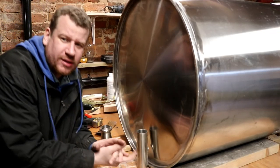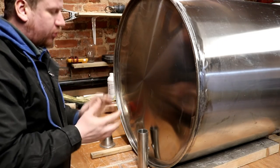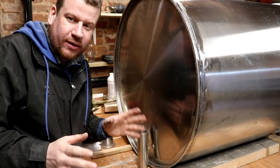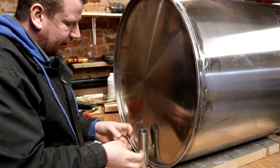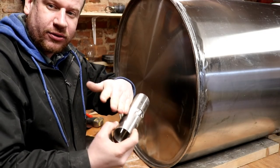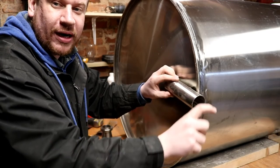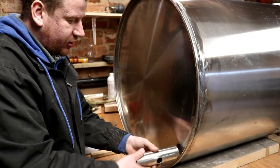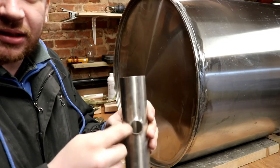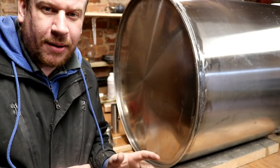I've spent much of today considering my position with tanks, fittings, and everything else I'm going to need to get this kit up and running. What I think I'm going to do with the mash tun — which will be a little on the small side for us, but we can work with it for now — is fit it out hygienically. The outlet edge is going to be cut to an angled point, come out the bottom of the tank, and stick on the front so it will fully drain the mash tun through that. Then we'll have just short stumpy legs on there — doesn't need much height on the mash tun. It's going to be a piece of two inch pipe, and that reminds me I'd better order some two inch pipe as well.